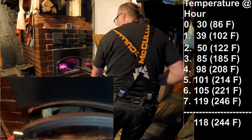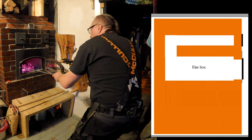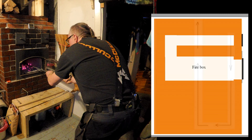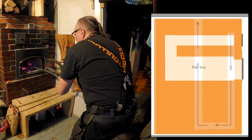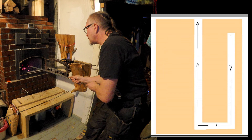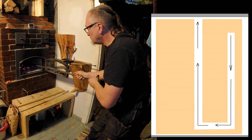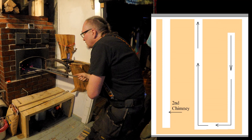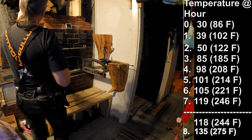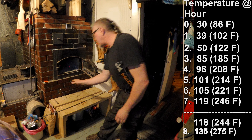While I do that, let me explain what's going on. I need to recap something from the first video. Here's a cross-section of the baking oven where you can see the firebox — what I call the nest — and the channels going up from it, which then combine and go across to the right into the wall of the house. Once in the wall, they go down all the way to the floor, go halfway back, and then go up the chimney. As I said in the first video, there is a second chimney. All the coals are now down in that hole.